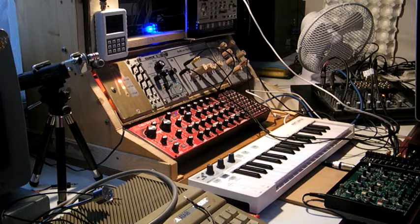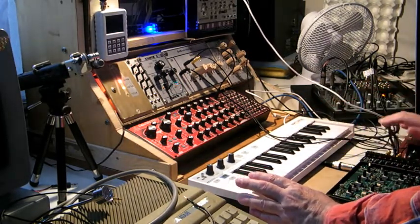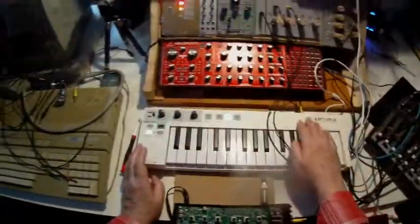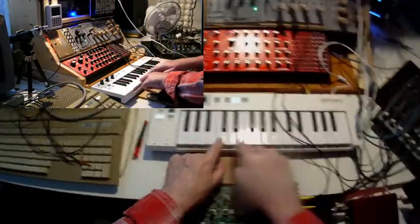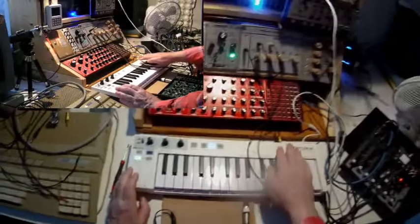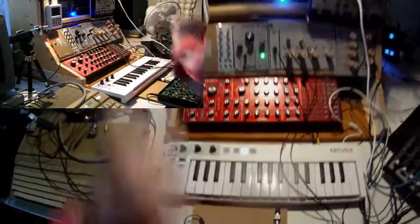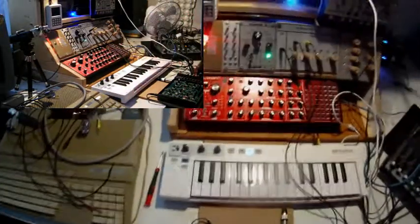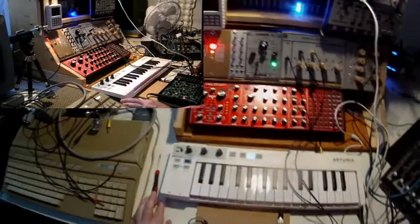All right, at first some words about the setup. The control voltage for the frequency of the oscillator comes from the Arturia KeyStep here. So I'm sure that the difference between two notes being 1 octave apart is indeed 1 volt. So 1 volt per octave characteristic is what this machine delivers. The reference sound comes from the Neutron. I know that this Neutron is exact as well because I have calibrated it very patiently. So it follows the 1 volt per octave characteristic.